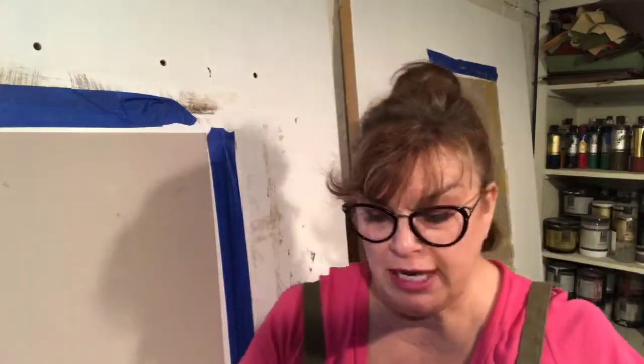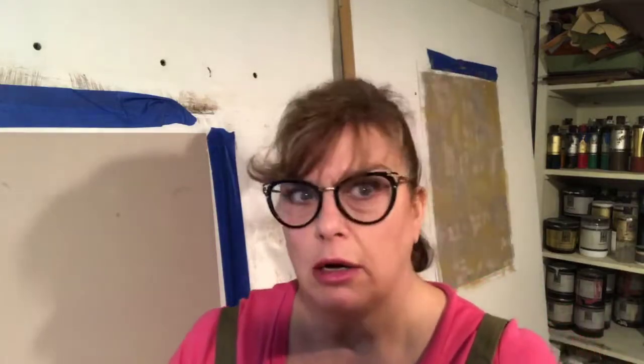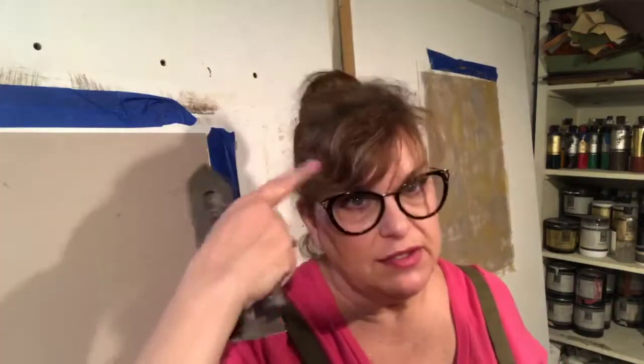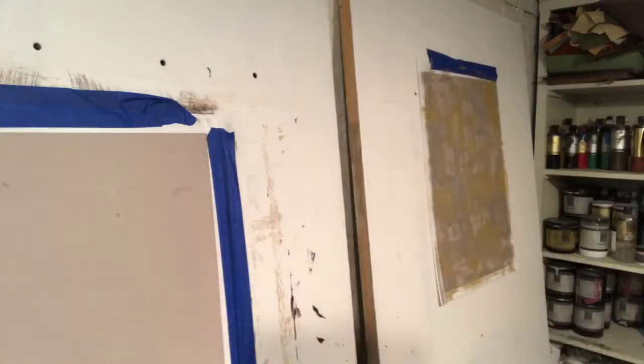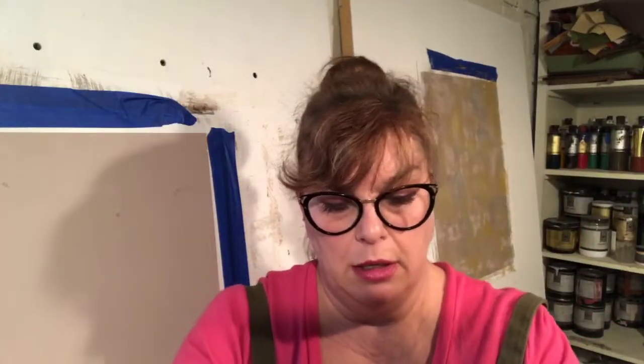Palette Deco is an interesting product — it's not plaster, it's not paint, it's a unique medium all on its own. For those who do art, it's very similar to gel medium. It has thickness, it's kind of plasticky, it dries shiny, you can apply it super thin or build it up thick. It's interior and exterior rated and dries hard. If you put it on super thick, it'll take a while to cure all the way through. It also sticks to everything.